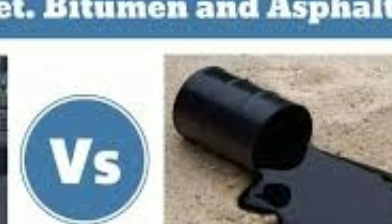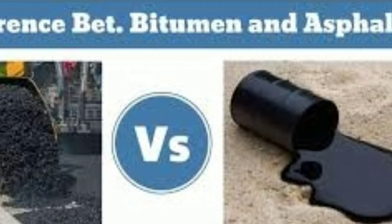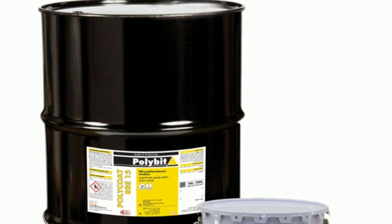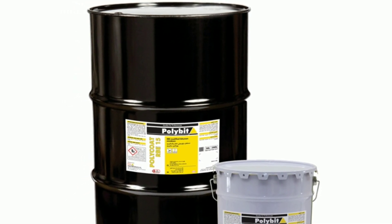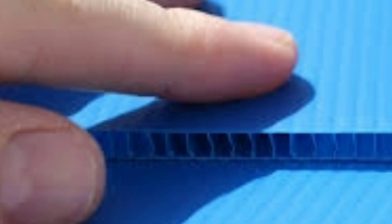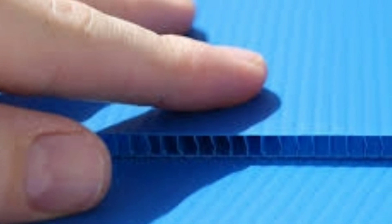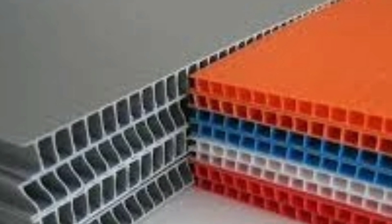When you receive this fiber concrete spacer cover block, you should also receive a verification certificate. After receiving all these materials, you should give the delivery note to your consultant. Number three: the third most-used material in the field is bitumen. After concrete footing, once you remove the shuttering, you apply bitumen. Most people use hot bitumen, but we use bitumen RBE, which is a cold bitumen. One drum contains 200 liters. This cold bitumen is very good for waterproofing after removing shuttering.